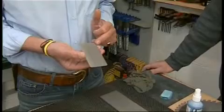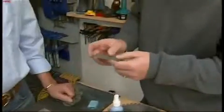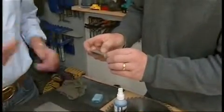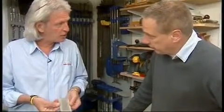This is a fine grit on this side — 600 grit, 25 micron. This side is 340 grit, 45 micron. If you just feel that, it feels quite fine. Turn that over and if you put your nail on it, you can feel the cut and the difference in coarseness and fineness. You can feel it cutting very, very quickly. I would suggest that everybody needs one of these in their toolkit. If you're out working on site and you haven't got the ability to get to a grinder or a bench stone, it is absolutely superb for putting an edge on a chisel or a plane blade. It's such a useful thing to have in your pocket or tool bag.